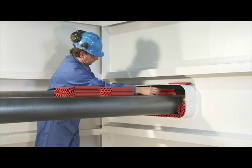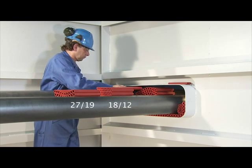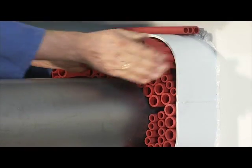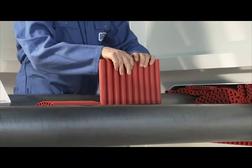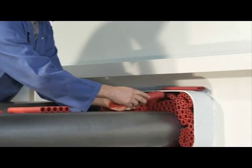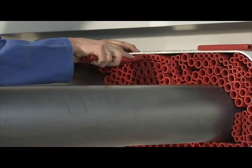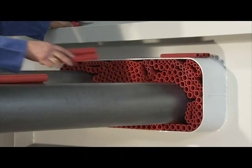The filler sleeves are available in two sizes. To fill the remaining smaller openings in between the multi sleeves, the required amount of multi sleeves can be torn off easily. To obtain the required mechanical stability, the complete set of filler sleeves must fit tightly in the conduit.